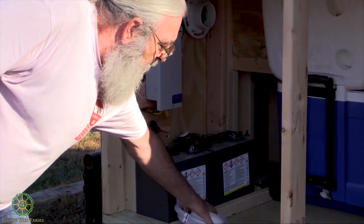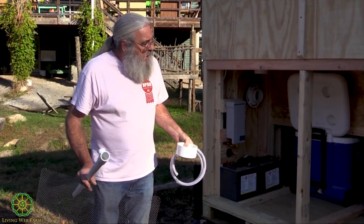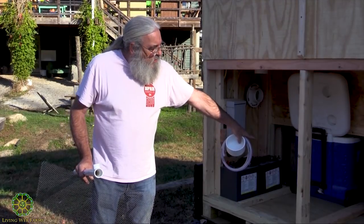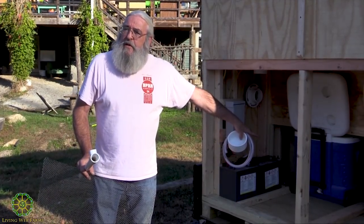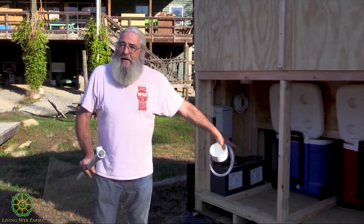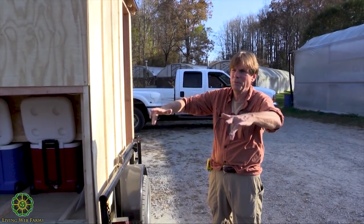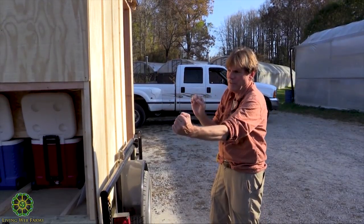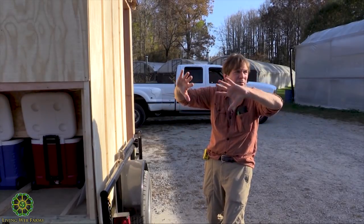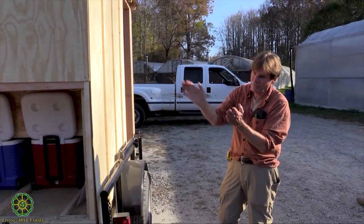How deep will the hose go into it? I'm still debating that. I say it's going to go down about 2.5 to 3 inches from the bottom, because that'll just clear the top of that drain in case that's needed there, so it's not actually bubbling into it. But the chances are anywhere that is blowing air into that is going to work fine. I want to keep it up a little higher because it'll make it easier to wheel those containers out slightly, then they'll tip a little bit and that'll relieve any plumbing, and then you can take it out. So the longer hose will certainly work, but it may slap back on you.